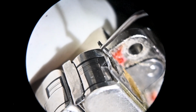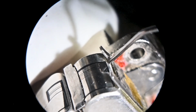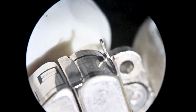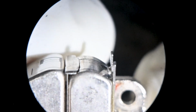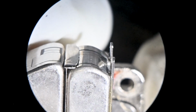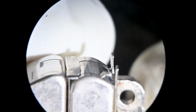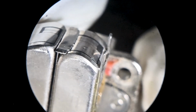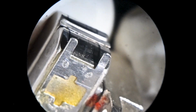Well, here's one of the problems with bending guides, of course. I don't have to say much about that. It's purely visible. If you look at that, the groove marks, the wear marks in it, they have reinstalled the guides backwards, 180 degrees of where they should be, because those wear marks are going the wrong path of where the tape cut into them.